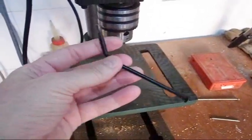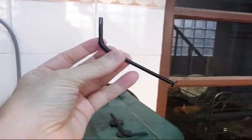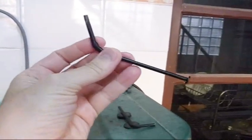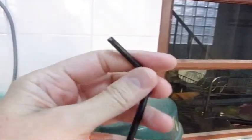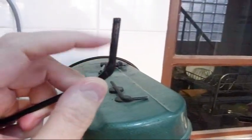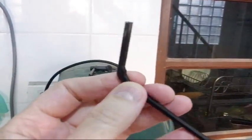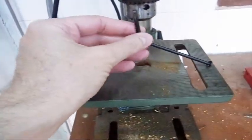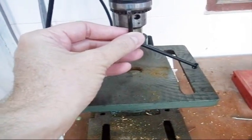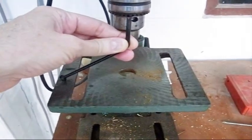The first step is to make a tool — it's a bent rod. This one I welded from two nails because I didn't have the right size stock. You want something very stiff that doesn't bend. The only trick is you want the part that goes into the chuck to be straight — not corkscrewed or bent in any way. It needs to chuck perfectly. This piece has to reach from your chuck out to roughly the same size as your table.